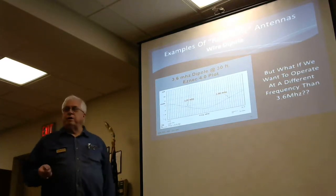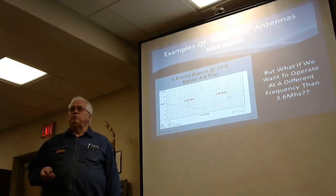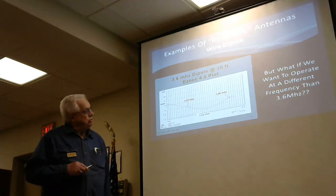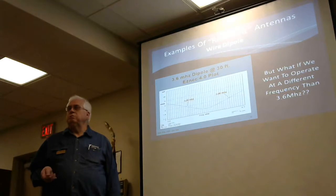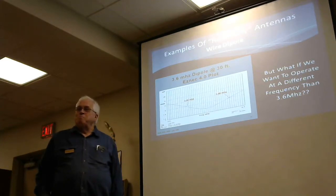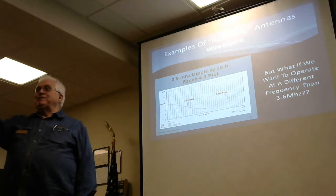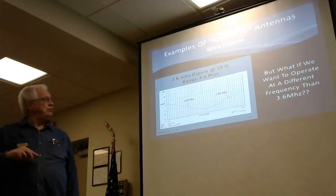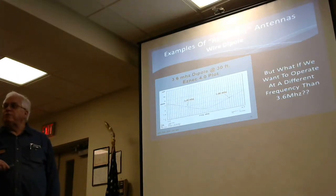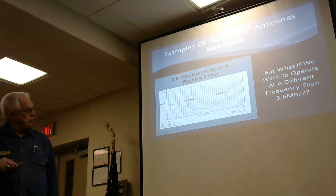Well, if you've got a modern rig, it doesn't like more than 2 to 1 SWR, and it's going to cut you back on power, you're stuck with 100 kc to operate it. That's kind of confining. It might work for FT8 or PSK or RTTY, where you've got these little windows. It worked great on that, but not for general operation. And if you've got an old tube transmitter that's happy with 3 to 1, you can tolerate 3 to 1.